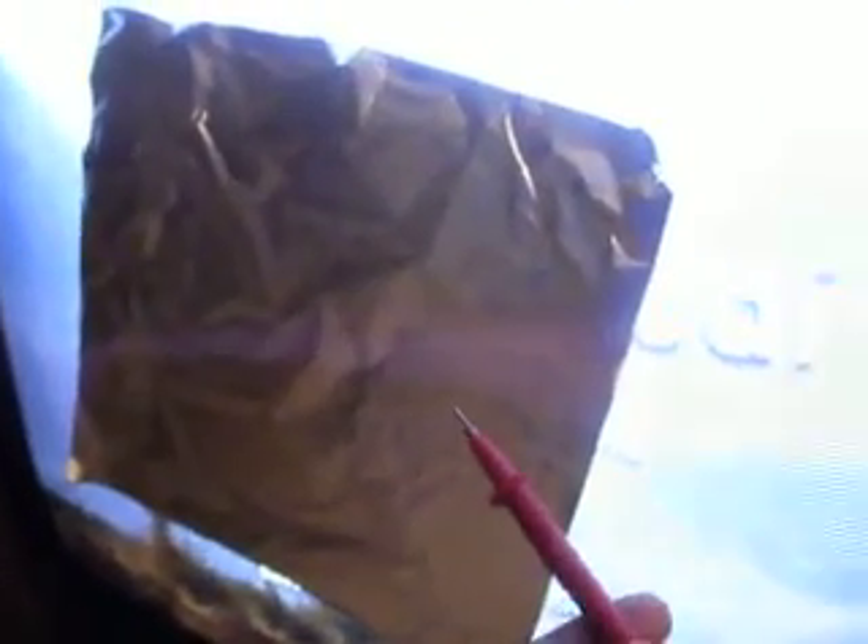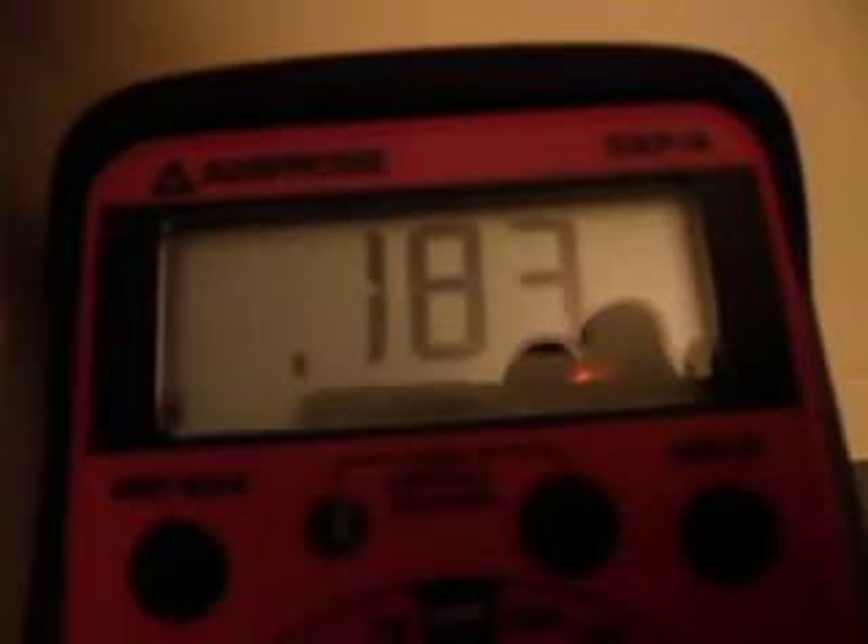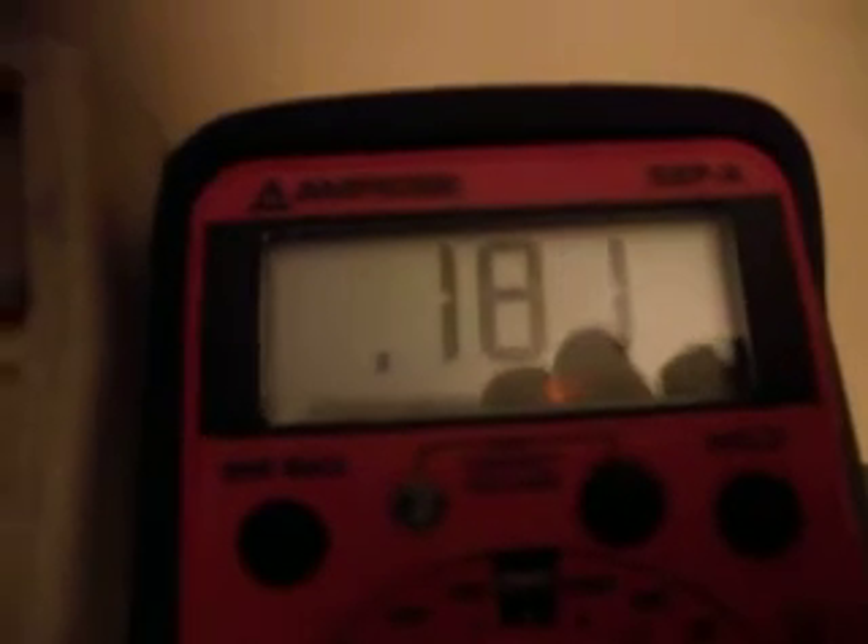Let's switch over to current and see what happens when we touch it with a current probe. So again the whole sheet of foil is vibrating. We can see that we have almost 0.2 milliamps coming off that sheet. So we're getting up into a significant current level, and you need to be careful around these voltages and currents on your TV. That's why I do not recommend people to put bits of foil on their TV screen — it's just something to be aware of.